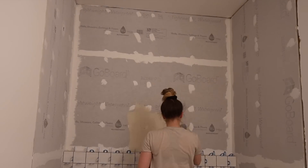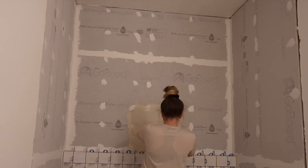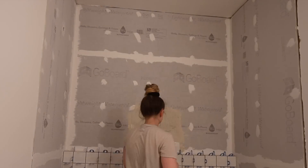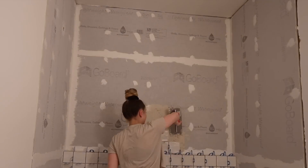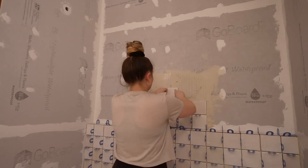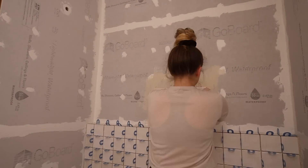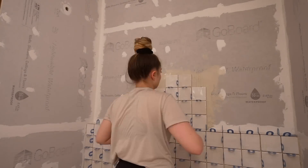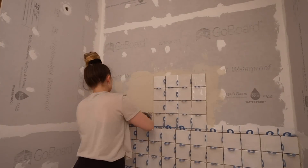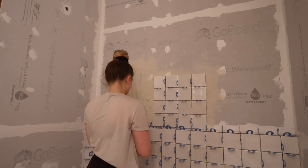Now we're on to the wall above the shower shelf. It was really important to me to have a full tile at the top of the shelf so it would line up with the outside edges seamlessly. Luckily, I was able to fix my math error with the spacers. If you're tackling this project, check your math many, many times — you want a cohesive layout with no super tiny cuts and everything flowing seamlessly. I highly recommend spending extra time building out your tile layout plan, then checking it twice.